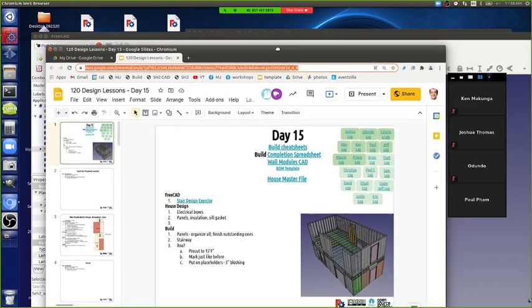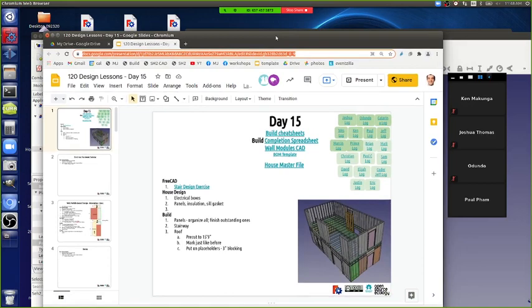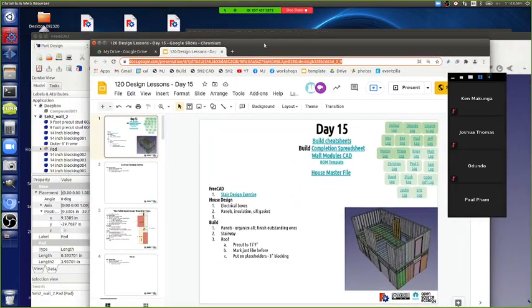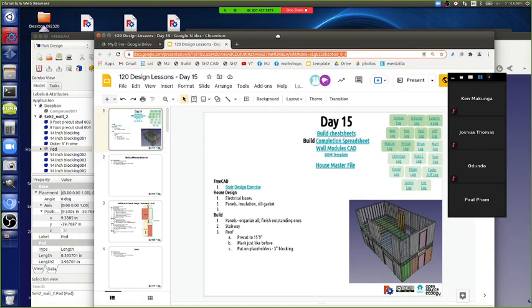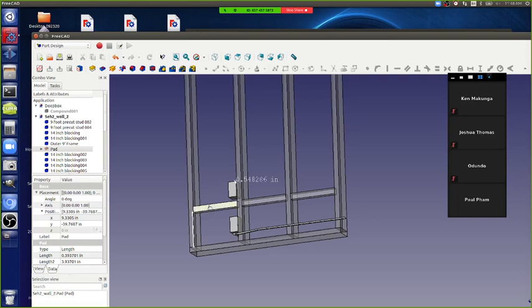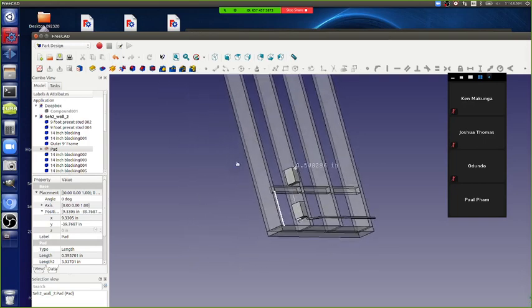So we're gonna mount electrical boxes. Are we gonna build a utility channel with, like, 2x4s? What we can do is pre-cut the materials for it. We would install that once in place, at the point where we're closing up the utility channel. The ideal procedure would be we quality control all the panels to make sure that all the utility channels are uniform, in case we miss some that are off. So that's one thing.